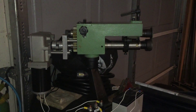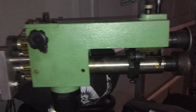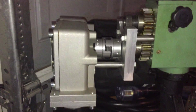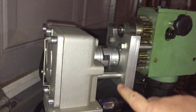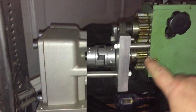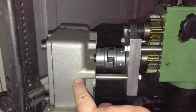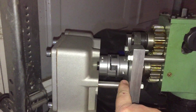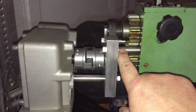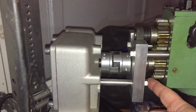I just got done putting the motor on my bead roller — it's a Chinese clone type bead roller that's usually hand-cranked. What I did was make this plate right here; it's got four holes in it to go into the bead roller, and the two bottom ones go into the motor/gearbox housing. Here are some pieces of half-inch outside diameter tubing, and I made these little standoffs with 5/16 bolts that go all the way through — it's very sturdy.